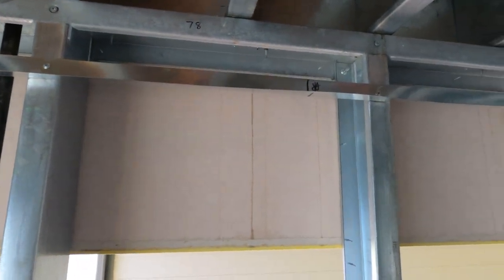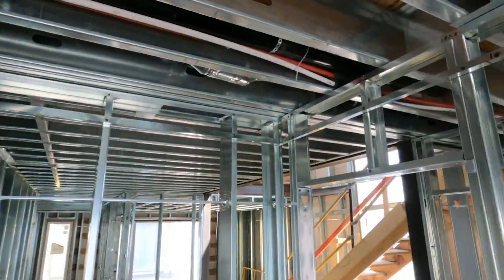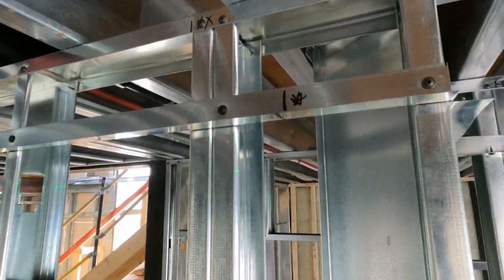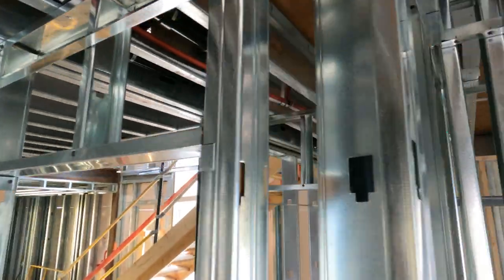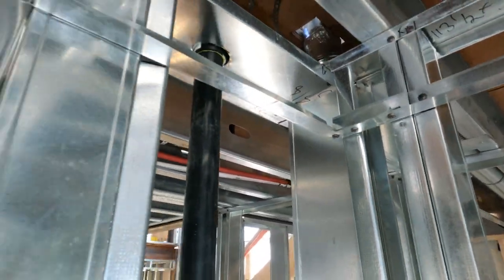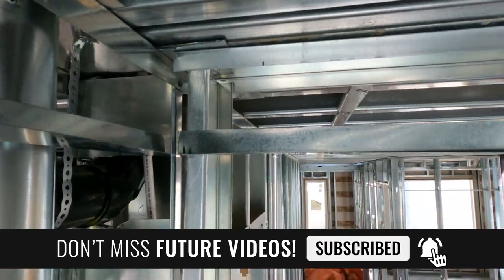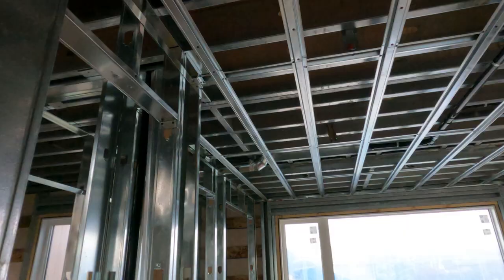Within four feet, and what I do in smaller sections is I even it out, divide it so it's nice and even. And when I'm bracing, the braces are going all the way to the back side of that angle so it's nice and tight. All the corners are screwed in and that way I can leave my floater studs floating — so I'm not screwing into those.